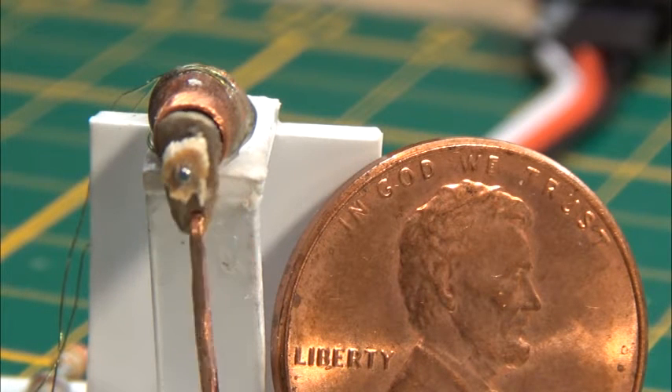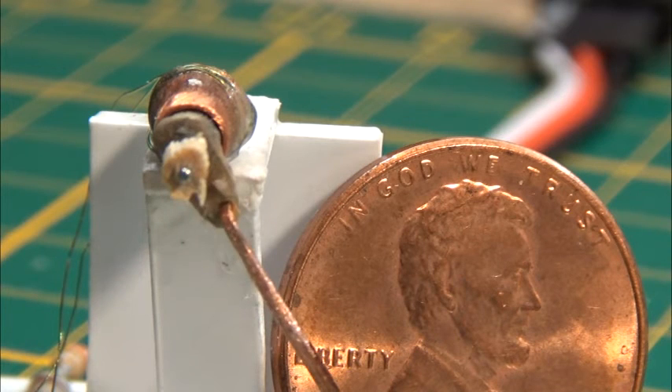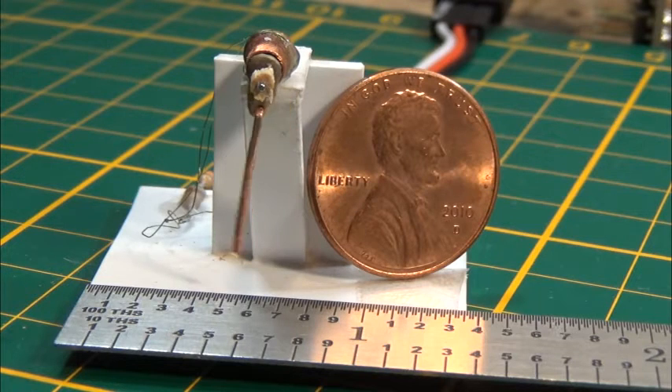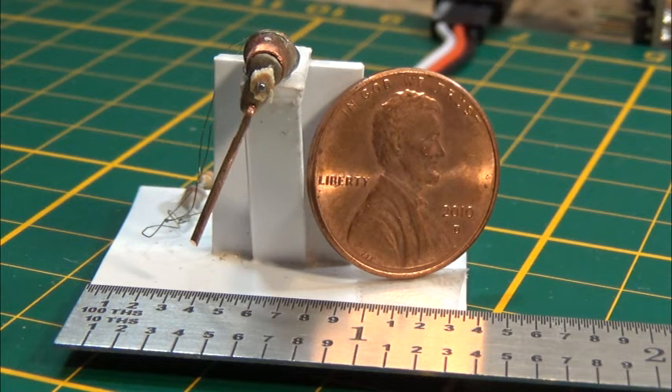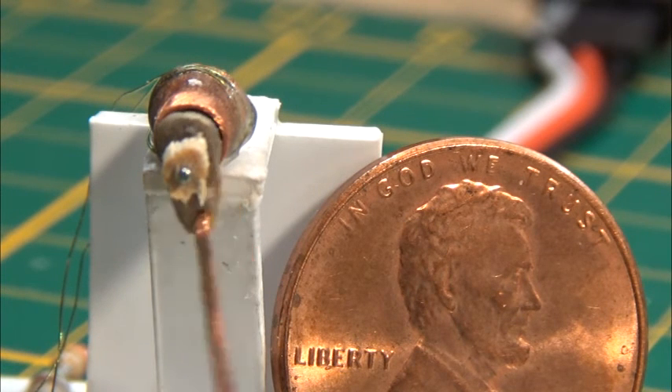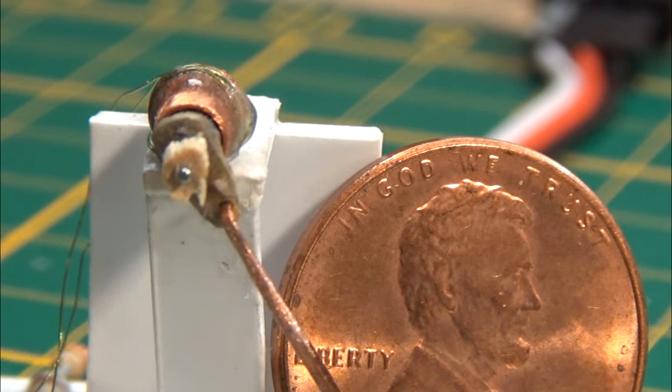So I went all out to try to actually make it move within the magnetic motor of the prototype. As you see here, I've gotten pretty far with this. It's still a little sticky, but this is all being accomplished with a small four millimeter coreless micro motor. I'm not using it as a motor — as you can see from the wires that exit the back — I'm using it more as a multi-phase solenoid, and using an Arduino to create the current to swing the magnet inside this core to give it this pendulum look.